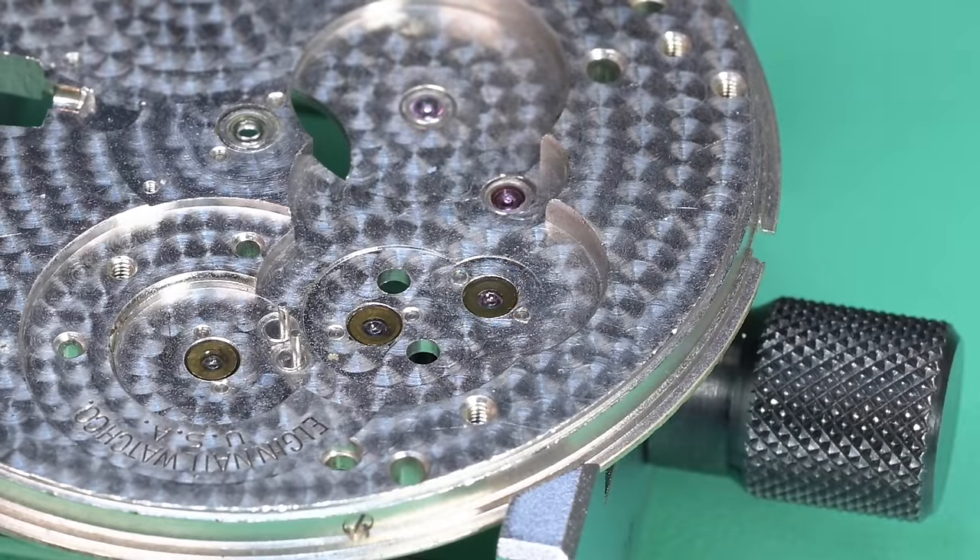There's a lot of friction in the crown wheel in a few places, so I'm putting some heavier grease on the winding pinion where it's going to interact with the crown wheel, and around that center post where the ratchet wheel center is going to go. We'll put in the crown wheel center and then the crown wheel. Another small dab on each side of the inside ring of the crown wheel — the crown wheel is going to rotate but the center is not, so there's going to be friction there and we want lubrication. We can pop that center down and put in our reverse-threaded screw.